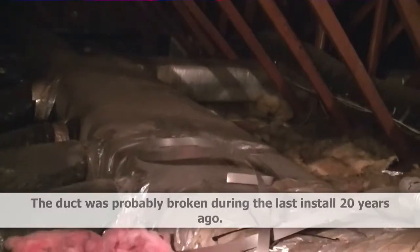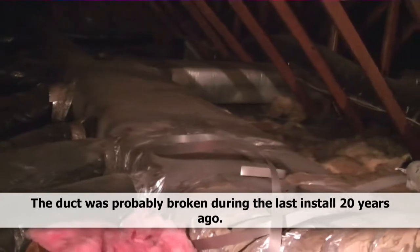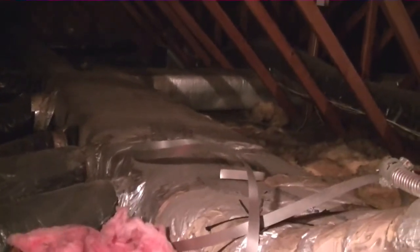This is our Nordyne four-ton air handler — it's Nordyne because R.E. Michael sells Air Temp, which is like a little sub-brand of Nordyne. We have our return: one off the top, two off the other side of this box. The little copper connections down there — it is a micro-channel coil. Got a little insulating to do tomorrow. The existing fitting was perfect for this deck, although someone broke the ductwork down on the first joint between those first two takeoffs — it's broken in half. So I'm going to have to repair that, but I'm going to do that last, because that was a surprise addition.